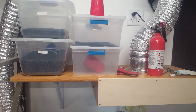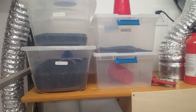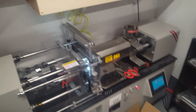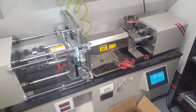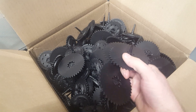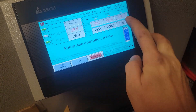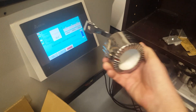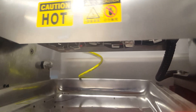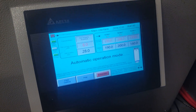Here's some of the plastics I've used before. I mainly use Delrin, which is a form of acetal — really strong stuff. I've found the right combination to get really good results in molding. All these parts are just really, really strong. You can adjust temperatures depending on what plastic you're using, and there are three heaters in there. The heaters are basically just ceramic — you can see them up underneath here. It heats up the plastic in three separate zones so it can get up to temperature.